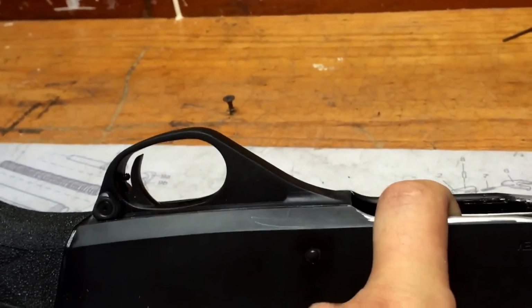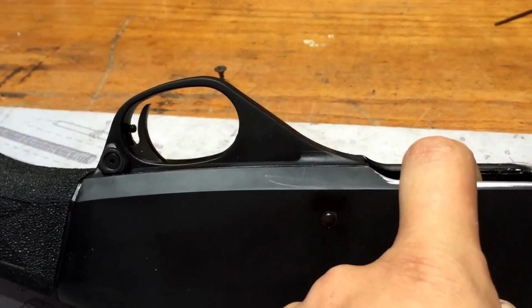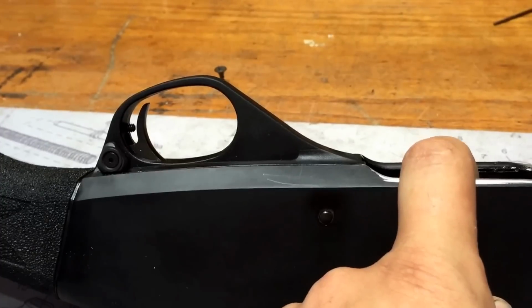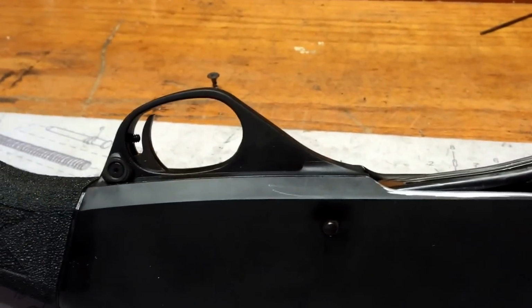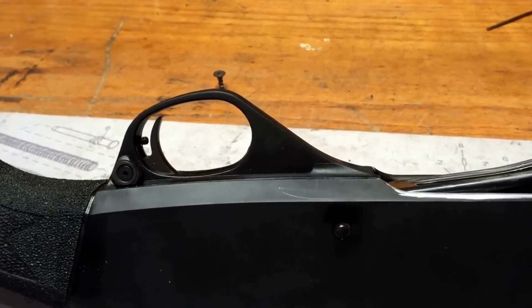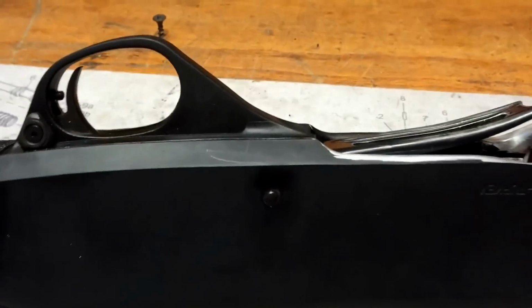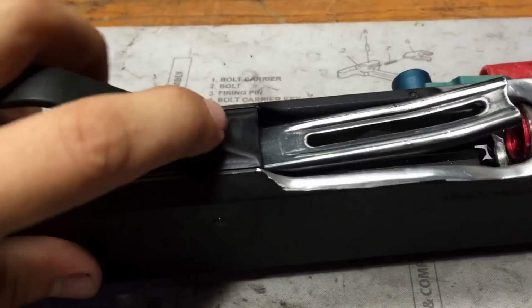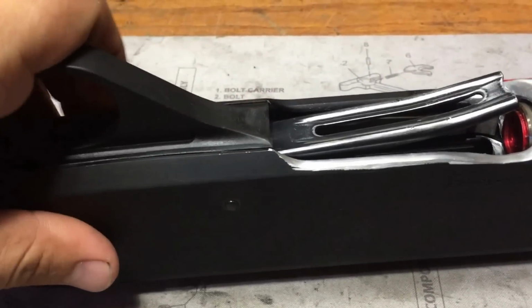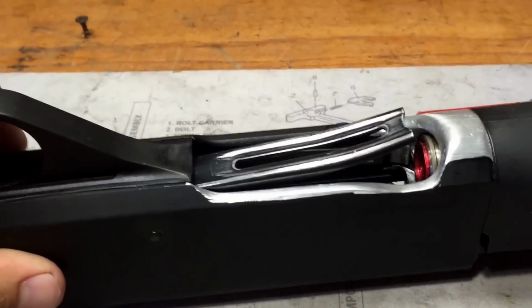And when it's pressed in here, it lines up really well with the trigger guard, which I still haven't really notched yet because I'm honestly kind of happy with the design of it going right into the loading port right here. I haven't had an issue with it really catching my thumb too much because I did push my loading port up a little bit further, and we'll get into that right now too. The other thing I did on the trigger guard though was notch this center area to give the shells somewhere to sit on their way down when they're riding the slide.